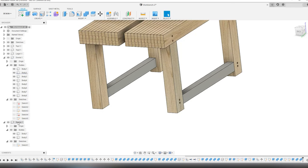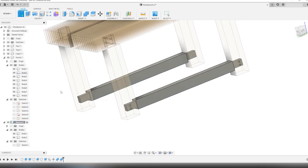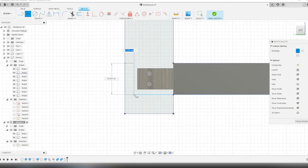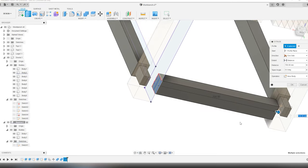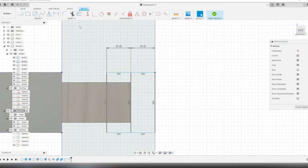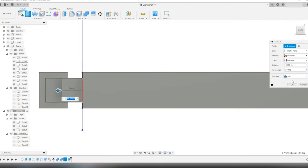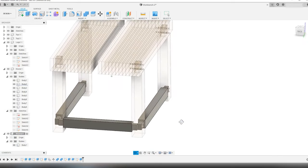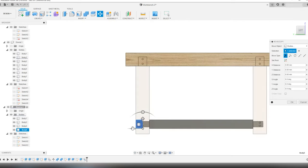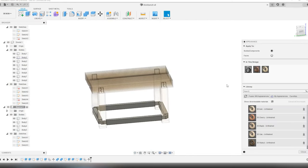Now it's time to make the short stretchers. I make and activate a component called beams. I use new sketch and place the sketch plane on the side of the legs. The short stretchers are going to be made out of two 2x4s. I'm using the same procedure as I already did on the stretchers, so going through this quickly. I'm also making the tenons on the short stretchers using the center rectangle tool, like on the long stretchers. When the short stretchers are modeled, I copy-paste-move them to the other side of the workbench. Then I add the same 3D pine appearance to all the stretchers.